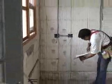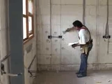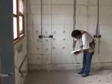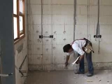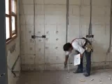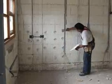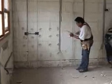And even though the blocks have been out in the sun, you get a slight amount of ultraviolet damage to the surface of the block where it goes slightly yellow. The dust that forms on there doesn't have to be removed because it's all mechanical. Whereas if it was a flat sheet, you would have to remove that to get the appropriate adhesion or batten the wall out. So this is the ideal way to do it because of the dovetail grooves, both for putting the plasterboard and render on the walls.